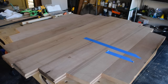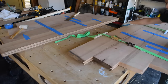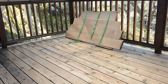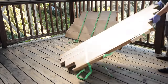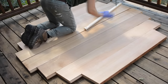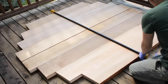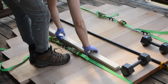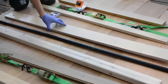I'm getting ready to take the floor from my shop to the house where it will be assembled. I can only fit half the circle in my car so I bundle each half to go. Here is the lower deck of our house where we'll have the hot tub. Originally we wanted to buy a plastic spa but no one could deliver it because we live on a steep hill accessible only by a narrow zigzag path with lots of obstacles. So building it piece by piece seemed the next best option. I clamp together the pieces and weigh them down as they begin to bow upward. Using stainless steel screws, I begin to attach straps to the bottom of the floor, keeping everything well within the circle that I just drew.